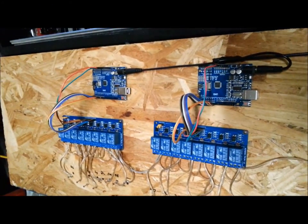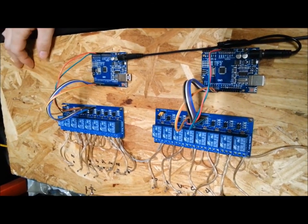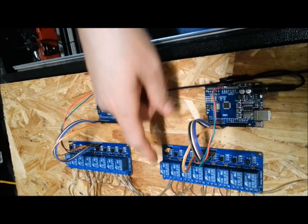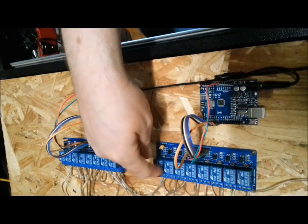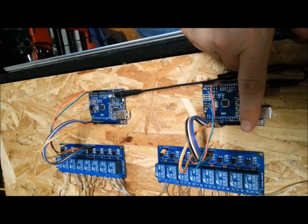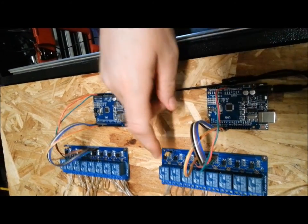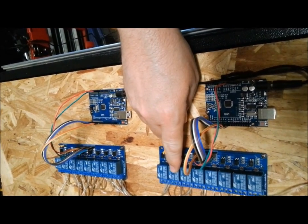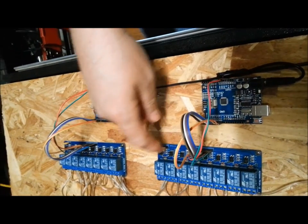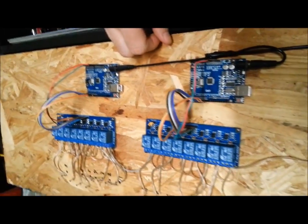Okay, what we're looking at here is my random room or floor lights on and off for my HO scale model railroad buildings. What I have here are two Arduino Unos, and each of these is a bank of relays. There's 8 relays on each bank. And what happens is, when they're turned on, the Arduino goes through a real small program, and it randomly chooses which relay to turn on or off, and then how much of a delay between the next cycle. So, when you see a red light come on, that means that relay's on, and that room will be dark, or power off.